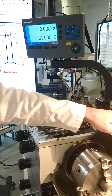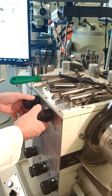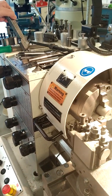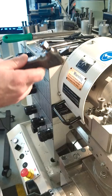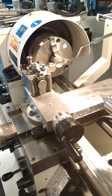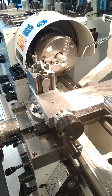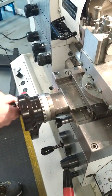You're applying a 1mm chamfer on. So again, your speed there, and we're starting machining here now, is 180. So quite slow, 180 RPM. The two options here are to use the carbide cutter or a 45-degree form tool like so. So powering on the lathe, it's just a 1mm chamfer, so it's quite quick. Powering on, and you're moving from 0 to 1. That'll give you a 1mm chamfer on the part. If you like on that part, that's it done. A small chamfer applied to the edge of the cylinder.